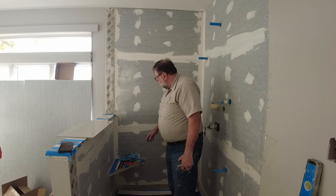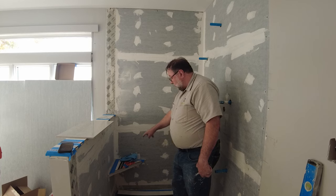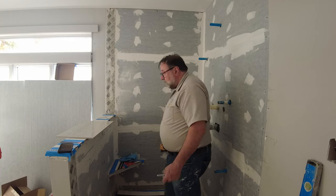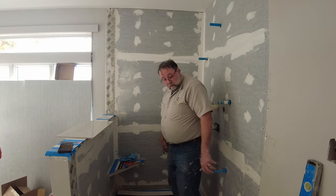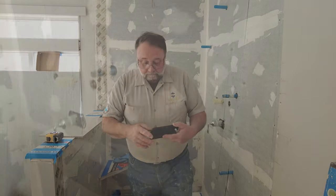That's pretty much the layout — this was an easy one. A lot of times if you get to the ceiling with only a 2-inch piece, you'll need to cut the floor tile to make that piece bigger. Always check what your piece is going to be on your seat and under any curves — if it's a little sliver, that's fine. So my layout is: full tile starting here, wrapping these corners. This layout took me 10 minutes; sometimes it takes an hour because you start in one spot and get a sliver somewhere else, or you have more ins and outs, and you have to compromise.